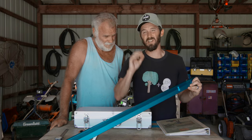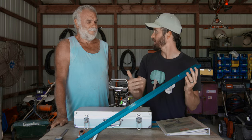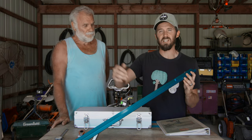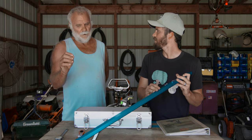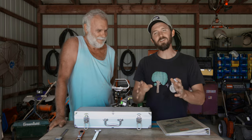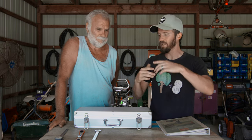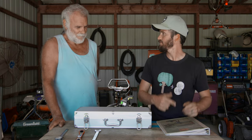This is the first video in a series where we're going to try to speed this green up. I just want it so fast it's not playable. During our investigation of the mower, we've also found that the bed knife and the reel do not touch each other — they do not cut paper. That is something we're going to get into later. The bed knife and the reel that does the cutting with all the blades on it have no contact, and there's supposed to be a very slight contact. There's a lot of things to investigate, so let's just get into it.